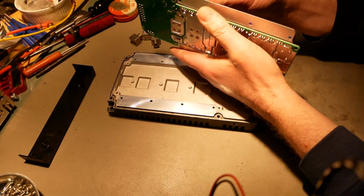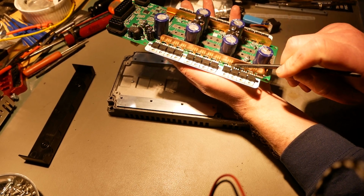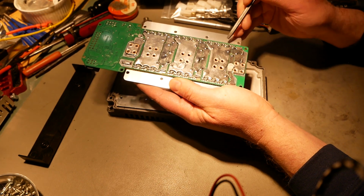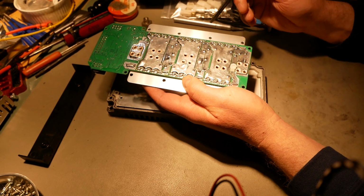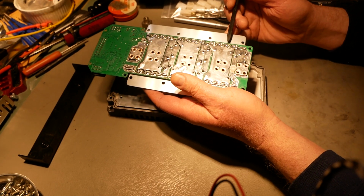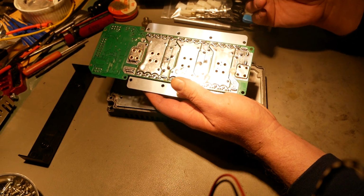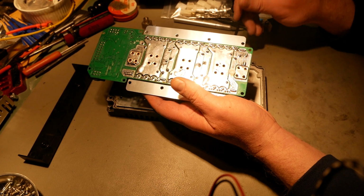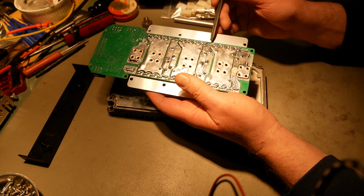And the same thing for the other side. So here's the positive side, that's battery plus bus right there, and you can see the same little pieces that go down. And on the bottom side, here's those little nubbins that go through right to the MOSFET leg. So battery plus and battery minus to the MOSFET legs couldn't be a whole lot better than this. This is pretty darn good. Right up there with, I don't know, if the EBMX current paths are like a 10, this is like a 9.5 or a 9.7. Yeah, this is very good.